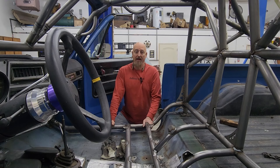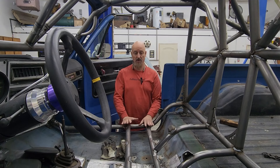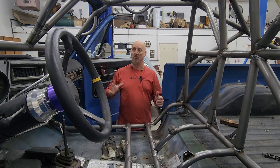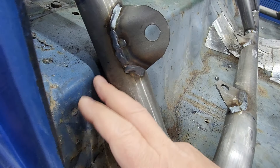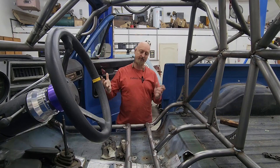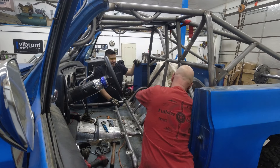We've run into a problem and an opportunity. When we were originally designing the cage, one of the things we talked about was making the whole seat support area removable from the cage, but we decided it wasn't necessary. Turns out it is necessary — when we want to remove the cage, we want to pull it back and then up and out. The problem is we can't come straight back without running into the bed, and we can't come up because the windshield frame actually wraps over the top of our cage. The solution is to just make this seat support area removable. So we tacked in some tube disconnects to the back of our seat support section and then removed it for final welding.